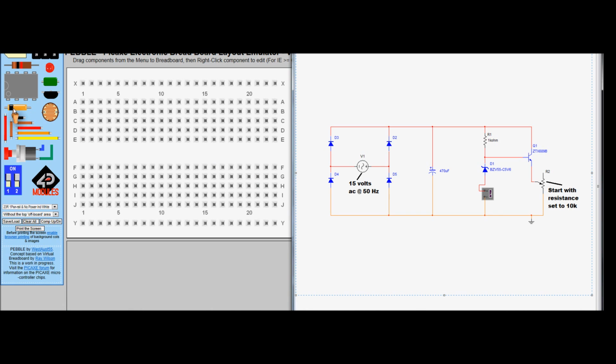This is the diode symbol here. I'm going to drag 1 and then 2, and we note they join on the same track, and that the cathodes, the black bars here, which correspond to these bars here and here, point to the power rail at the top. We're going to do exactly the same for D2 and D5, but on the other side.